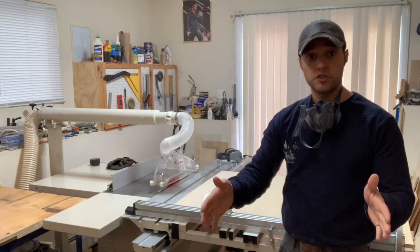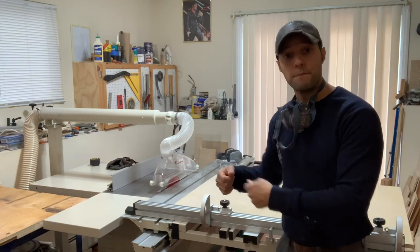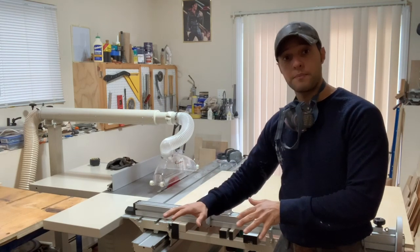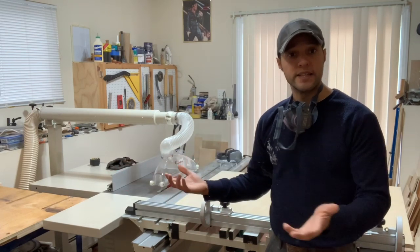I'm going to make it 12 inches wide on each side, so I have my rip fence set up as a stop at 12 inches, but I'm going to back that rip fence up so that it's before the blade. That'll act as a stop, and then as I come through the blade with the cut there will be nothing past the blade to bind it or cause any kickback.